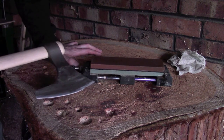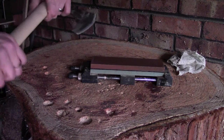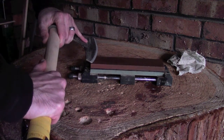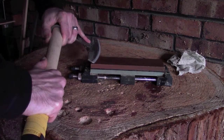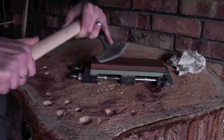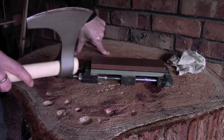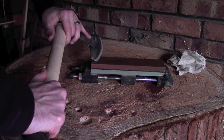The other method I mentioned: you can also use a circular motion. You start at one end, pushing forwards - the blade needs to feel like it's biting into the stone at all times, not pulling backwards. You're basically trying to take off that very thin layer. I've now flipped over to the 1000 grit side, so this is really just refining the blade and what I've already done. I'll spend the next couple of minutes finishing this off and then we'll give everything a test cut.